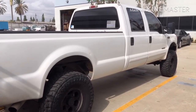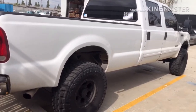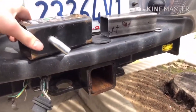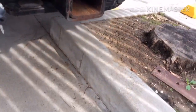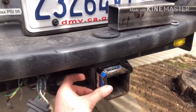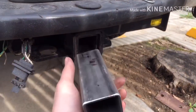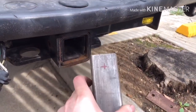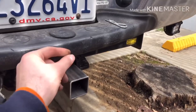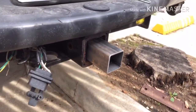I'm gonna make a trailer hitch receiver with a flagpole on it. My truck has a two and a half inch receiver and I already have the two and a half inch to two inch adapter block. This is just gonna slip in here - it's got the hole for the pin to line up. Then I have a two inch square tubing all marked up with my measurements to slip in here, drill the holes, and the flagpole is gonna come straight up. It's only gonna be about a half inch away and about a five foot flagpole.